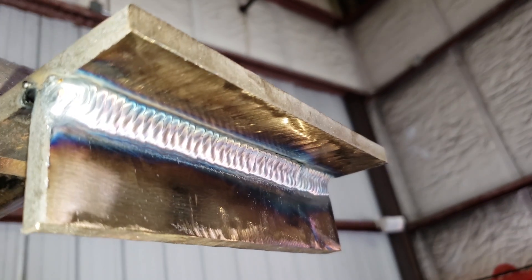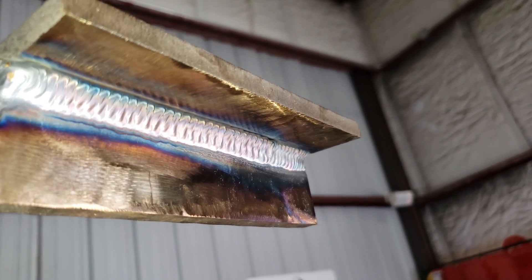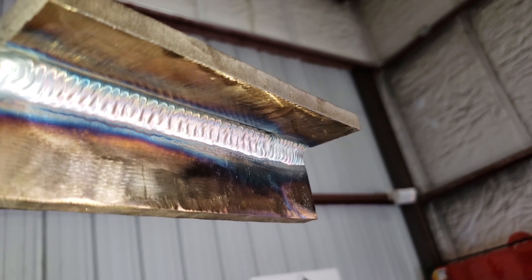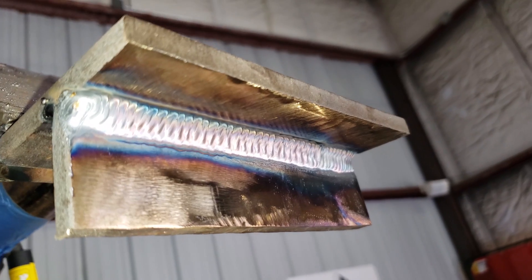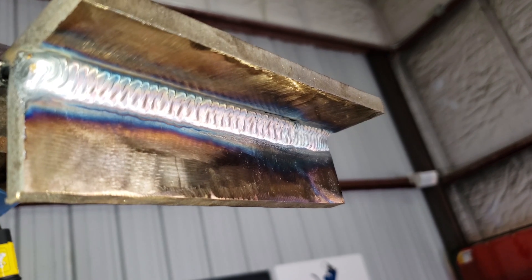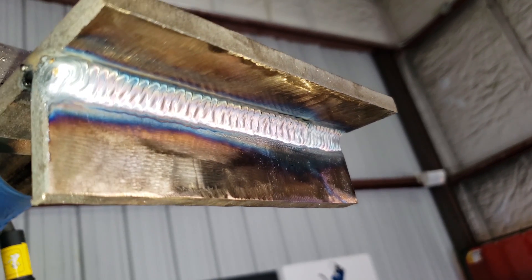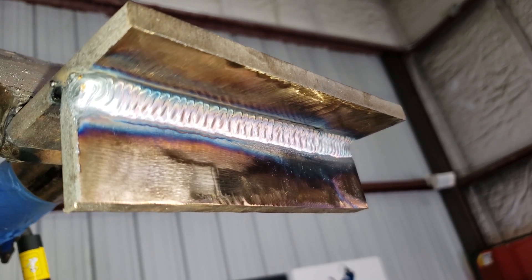There you have it. As you can see, the very right side where I freehanded it — I made it nice and tight so y'all can see how it looks when you're freehanding or wiggling the cup nice and tight. The rest of the way I did a butterfly effect kind of weave, just giving you a different taste of what you can do. Hopefully this helps you out, especially when you're running overhead with TIG — definitely wiggling the cup, and your arm gets real tired. Just make sure you're nice and relaxed on your arm and wrist, keep that rod on the upper side of the puddle, and make sure you run hot too. Overhead TIG welding on the 4F position, T-joints. Hope y'all learned something — if you did, give us a thumbs up and subscribe to our channel. You can follow us on all the social media — Snapchat, Instagram, and Facebook — all at WeldTube.